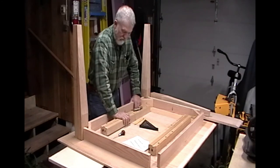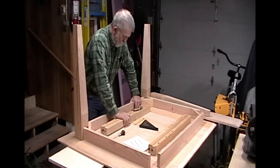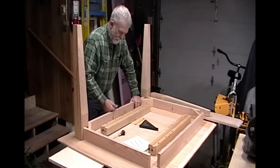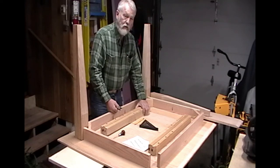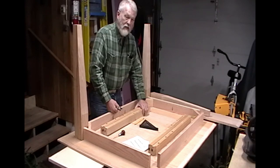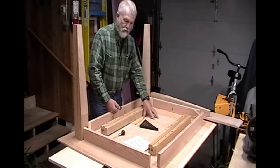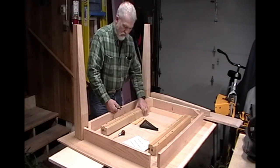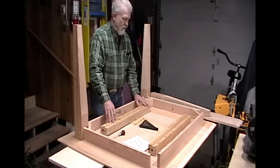After that, I actually had these wood extensions from another table I had built years ago, and I attached them. I used number 12 wood screws, 1.5-inch screws, so I'm about 1/2 inch, maybe just a shade over 9/16 into my tabletop, which is 3/4 inch. There's three screws on either side, and I've got them attached.